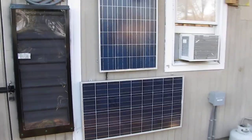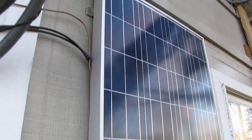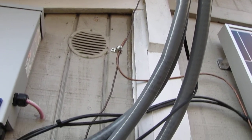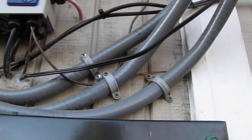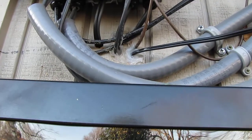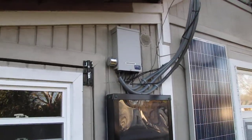I'm running them at 24 volt. There's my ground tied into a ground lug, and then I run a PV cable right here, all nice and neat and tucked in there. I also ran my other leads today from my pole mount — that's gonna be pretty cool.